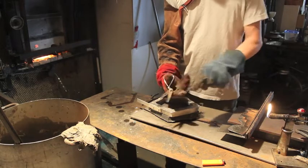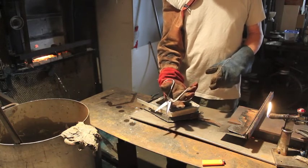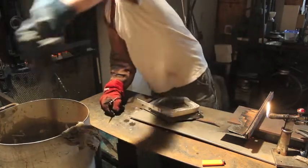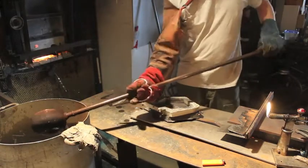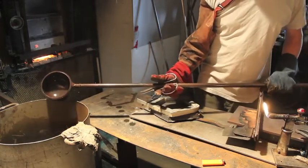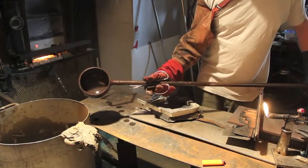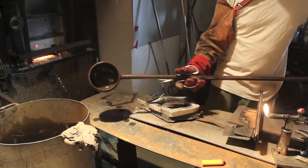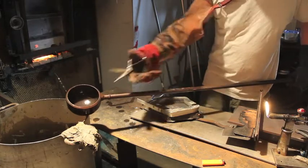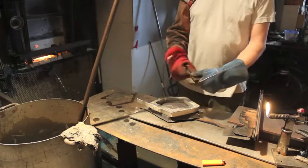This is a very important tool — not only is it used for cutting off the stringers, but it's used to hold the ladle so that the hot ladle isn't actually touching the glove; it's resting on the scissors. That's how I hold the ladle — I can slide it up and down on the scissors, get really close when I'm pouring, and if it gets a bit too hot I just back it up a little. The scissors are in my hand ready to do cutting.